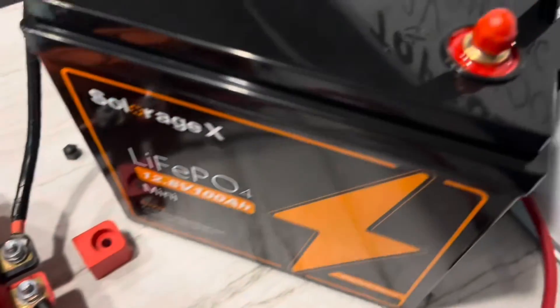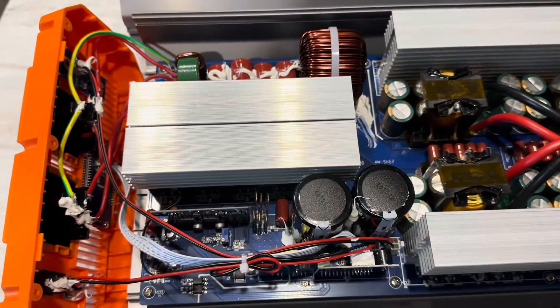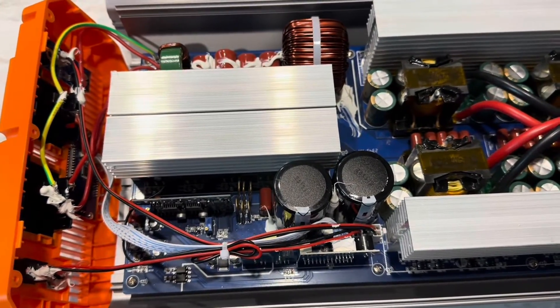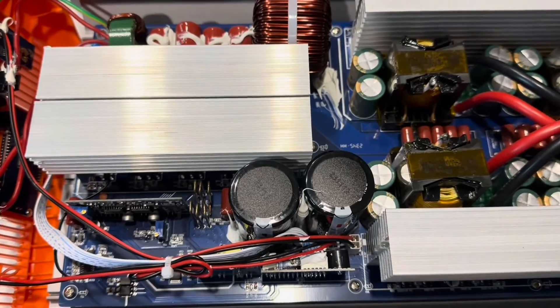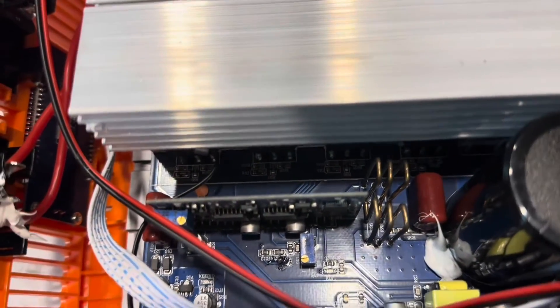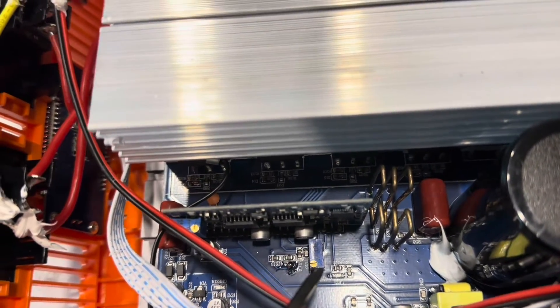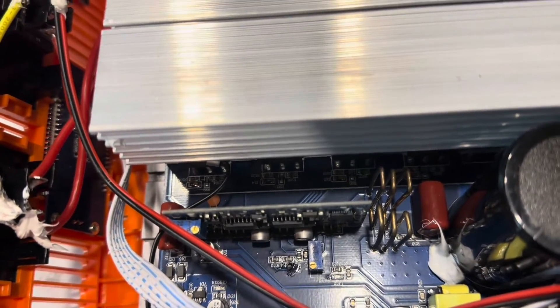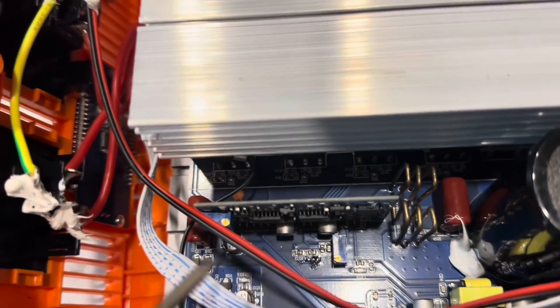I'll show you the general control circuitry. I've got the power off on the inverter. Capacitors are discharged, so it's safe to point around and touch stuff right now. A lot of inverters are built like this with this control circuit, so you can adjust the current and voltage, which is nice to find in this inverter — that means I can get a little bit more power out of it. On the control circuit right here, there are two different trim pots: one for voltage and one for current. I'm just going to adjust the one for voltage today to increase the output voltage on this top bull inverter.